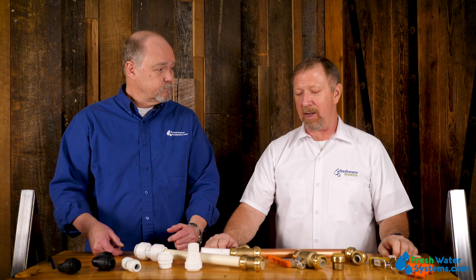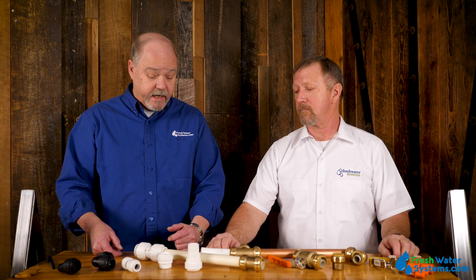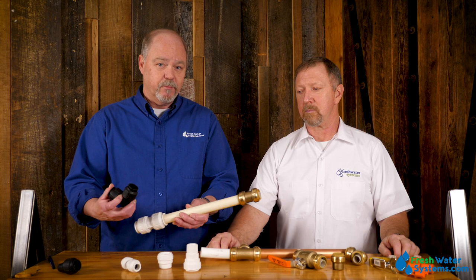Let's talk about the application. Typically these are used for household plumbing. What about outdoor use, behind-the-wall use, or possibly even buried use? SharkBite fittings are rated for being behind the wall or underground, but I would prefer to have the fitting where I could see it so that if there is a potential leak you'd be able to get at it and fix it before it becomes a real problem. The other issue with outdoor use is the O-rings in the SharkBite could be exposed to UV light and potentially damaged. In the plastic connection world, white or off-white fittings are not UV protected. Black fittings give a little more UV protection, but any fitting with a rubber seal is going to be suspect in extreme environments.